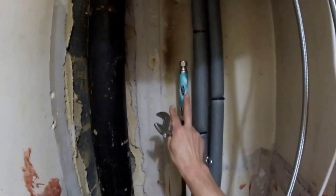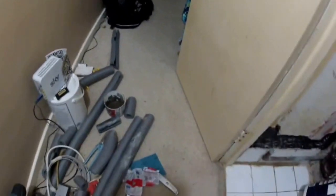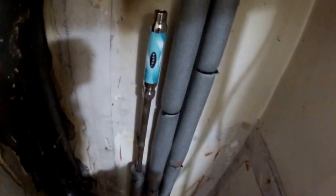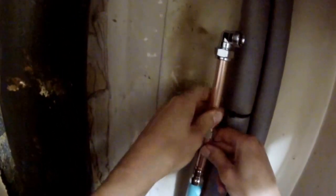As you can see, I've put in a limescale inhibitor because you don't want limescale in your boiler — you want to give it a decent shelf life. Now this is in. Don't forget to put this piece in first and then the O-ring later, and just put this fitting in here.